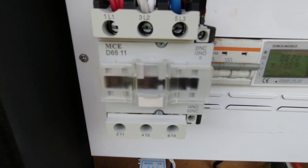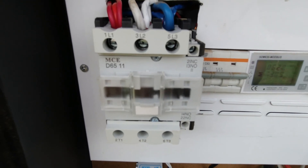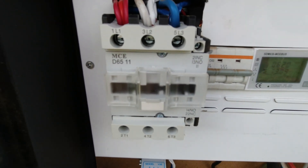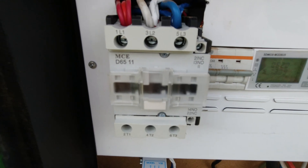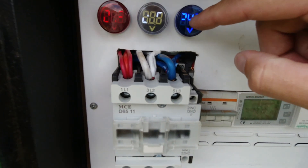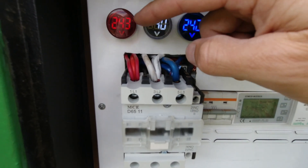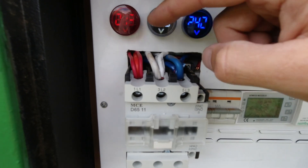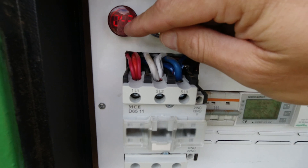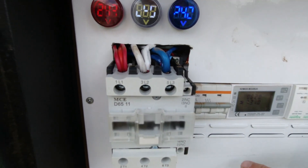Do make sure that it works. Switch off your power, pull out the cable, switch it back on, and see if your contactor pulls in. If it doesn't, you know it works. Check your voltage with your multimeter and see if it correlates. You just run a little cable from here to your blue one, white one, to the white or yellow, and then red to the red one. At the bottom there's a little connector you'll see on the photograph that connects all the neutral cables, and then from there to your neutral bar.